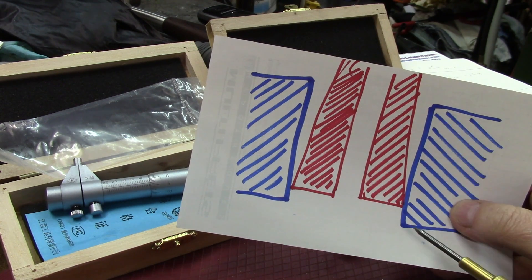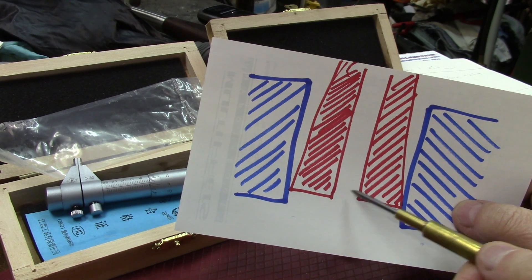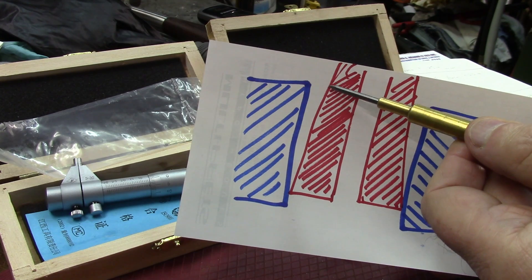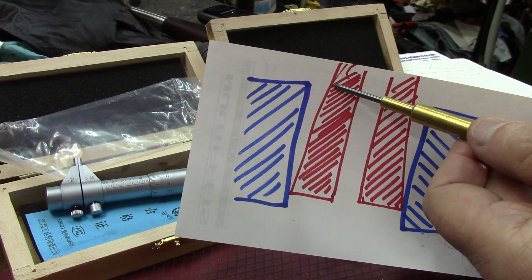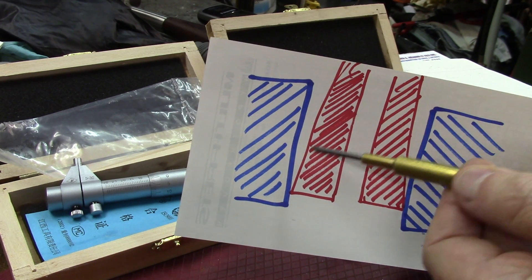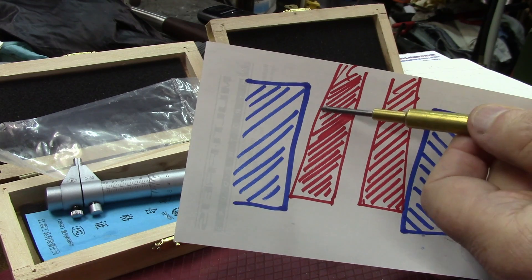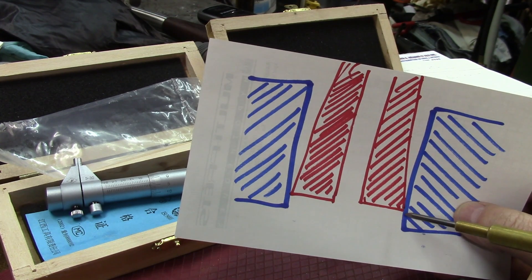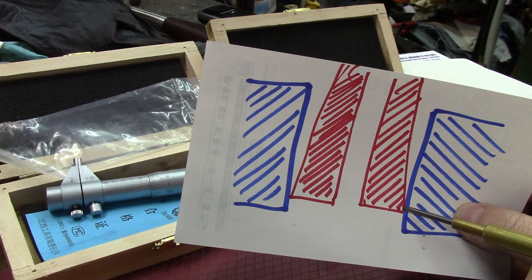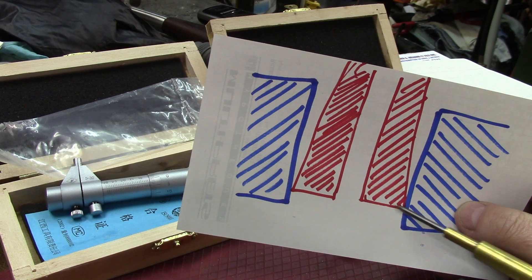This is the inside cross section of a ring — a calibration ring or any bore you want to measure. These are the two jaws with the opening in the middle. It's greatly exaggerated, but it's just to show what's happening: there's only one part that touches inside the ring. On very good quality instruments, you'd have much better parallelism between those two surfaces. This means readings are not as reliable as with a well-built tool.